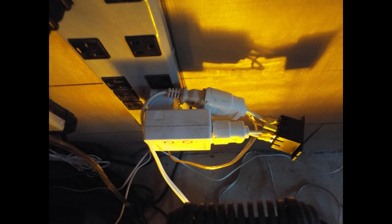The only downside to this extra relay setup that I built is you must use an appliance module. You cannot use a lamp module — the lamp module will not trip the little relay. You must use the appliance module.